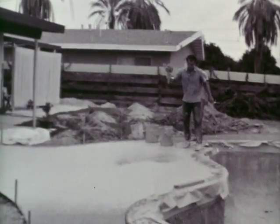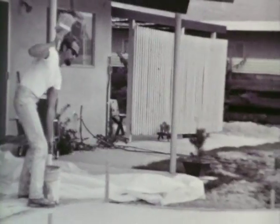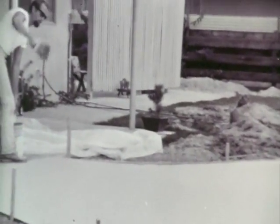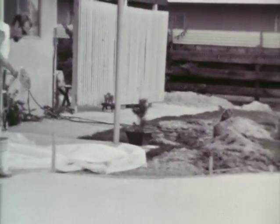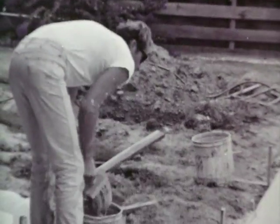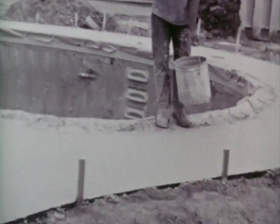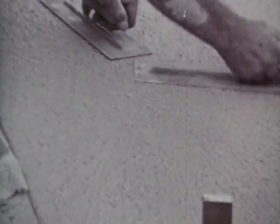Overlap just a little so as not to leave bare spots. Before the first splash loses its glaze, dip the brush to half the length of the bristle and rain on a second splash. This leaves knolls and voids of sufficient height to trowel. Glaze leaves the surface. Hold the trowel lightly and flat. The pattern is set with the first pass.